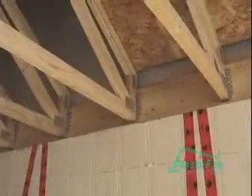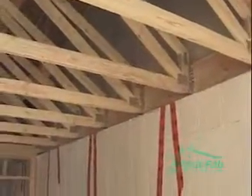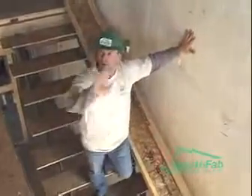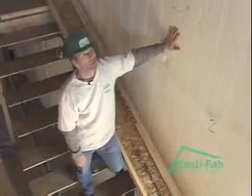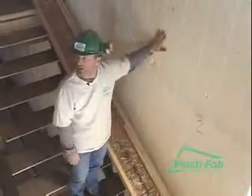Our rafters sit on top here. The main rafter is fire rated and sits right on top of the concrete wall carrying the load. The ledger sits on top of that to carry all the other jack rafters. This place is in pretty good shape — they're pretty much ready for drywall as soon as the sub-trades are done.